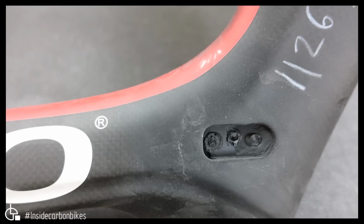So now this is where it gets really interesting, because you might be able to see there are some cracks around the head tube junction there and there. And in fact, this whole area through here is delaminated. The owner of the bike, a local guy in Melbourne, was riding out near Warrandyte, which has some up and down hills. He said that he was braking normally down one of the descents, and the bike started shaking like the headset bearings were loose.